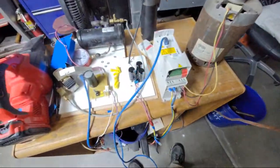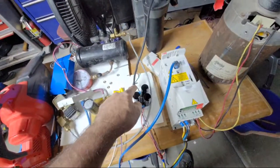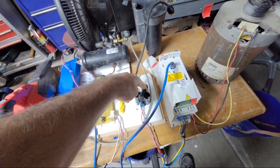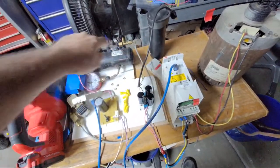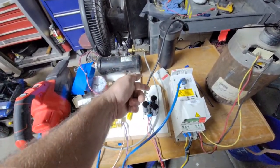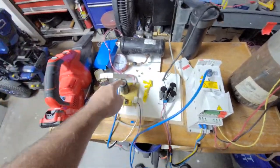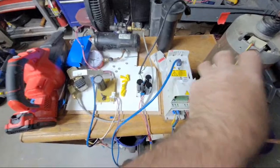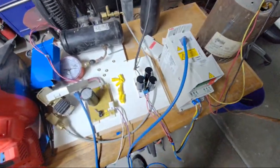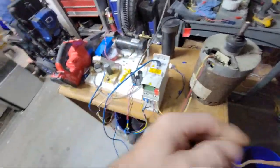So knowing that, I can use a voltage doubler or voltage tripler, which this is, and this 115 volt AC is going to charge the first capacitor with one half of the cycle, and then when it goes the other half, using diodes, it's just going to put this in series with the next wave, which is across both of those, and then you get double, and the one inside the device is charged to the double. And then with 3 of these or whatever I have in here, it does it each other half cycle and basically keeps doubling it up.